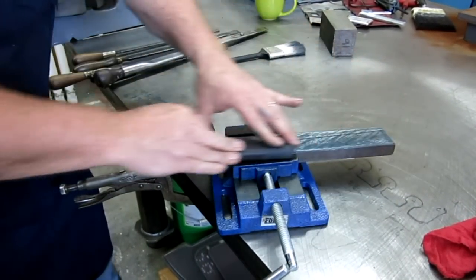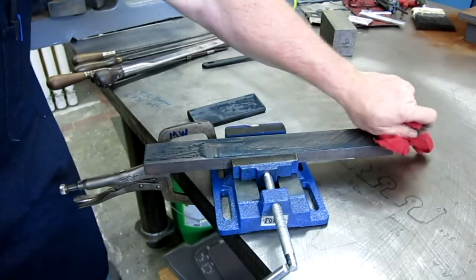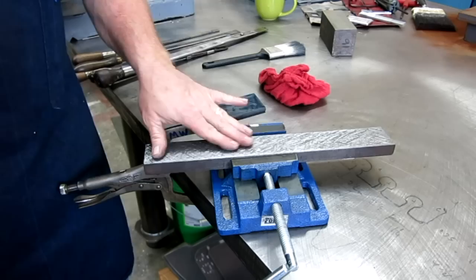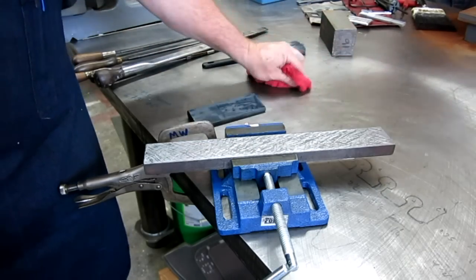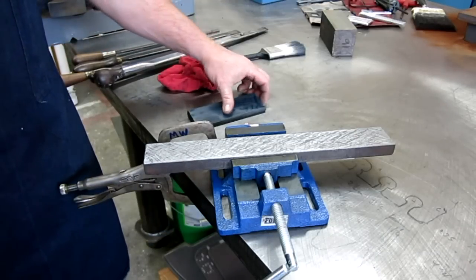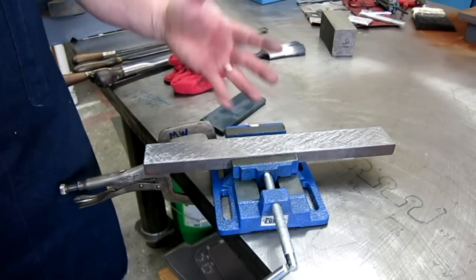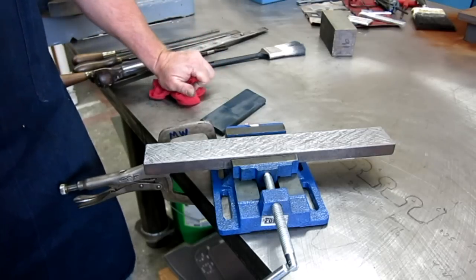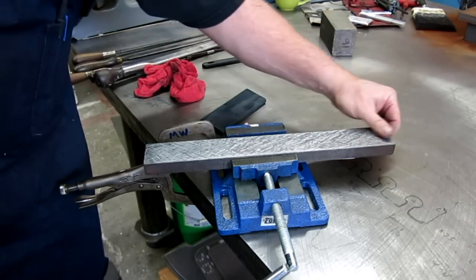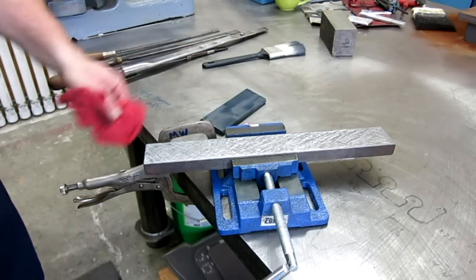So are you making a standard for scraping dovetails? Yeah. I got an antique Flather lathe, pre-1900, and we're going to hand scrape this so we can do the dovetails and the saddle on that. Now, did you make this whole thing? No. A guy that took the Richard's class with me in 2013, John York, had the blanks. He said, you're welcome to it, 50 bucks. Oh, done. Sold. I've been working on this for about 2 weeks off and on, trying to do it all by hand, just to make my skills a little bit better.